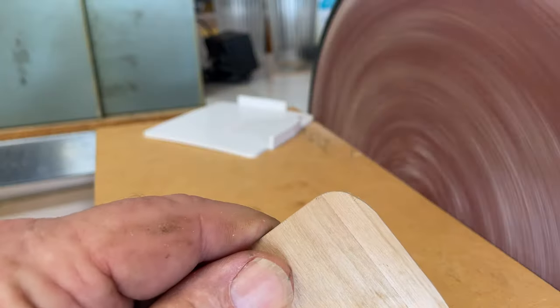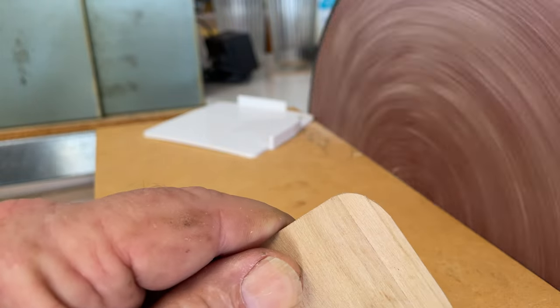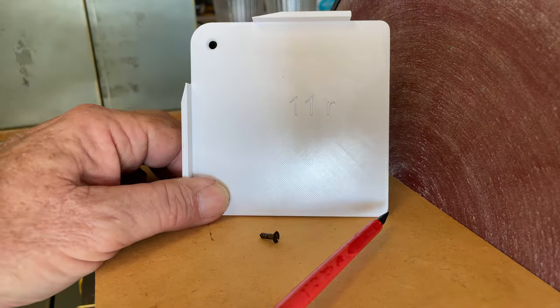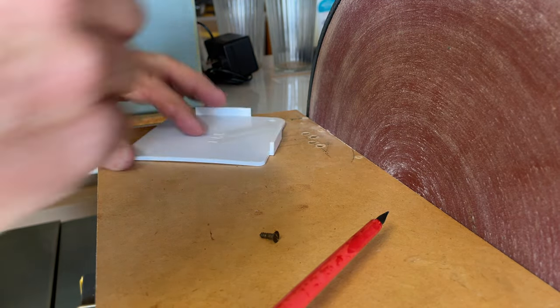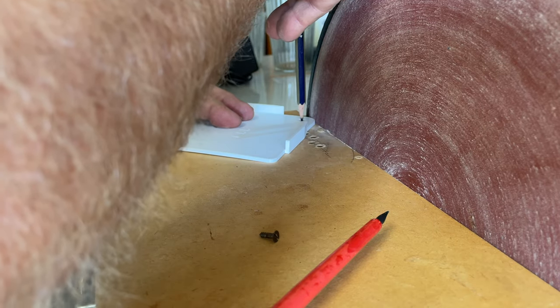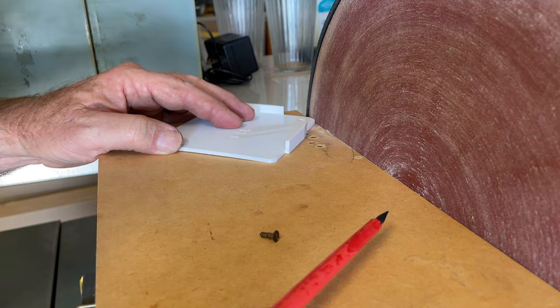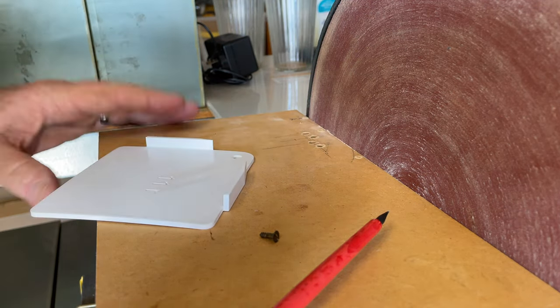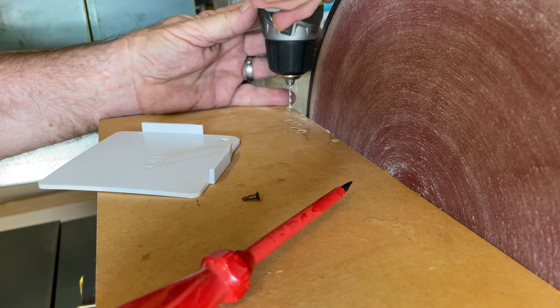His is an 11mm radius to suit the trench cutter for the base in his boxes. To set this up, simply mount a piece of ply or MDF on your sanding disc station. Place the jig right up until it almost touches the disc. A business card could be placed between the jig and the wheel if you are concerned, but the plastic won't be harmed by the disc if it touches it lightly.